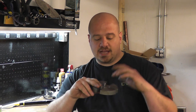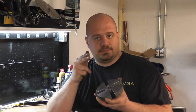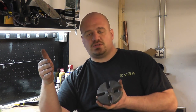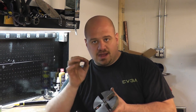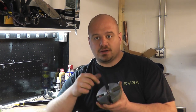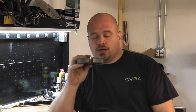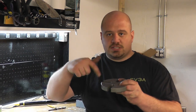To do that, I had to use a boring bar because it was off, and if I were to try to drill it, the drill would want to wander back into the same hole. So I just got a tiny boring bar and kept enlarging it until I got to a 3/8 diameter, and then put Loctite on a 3/8 roll pin in there and re-drilled the hole in the Arbor press with 3/8. And I also went around all these little cutouts here